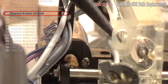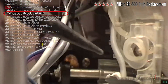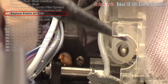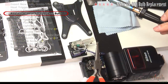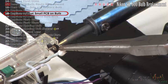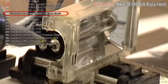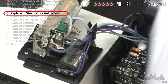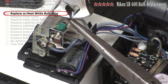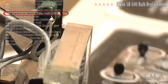Replace the end of the elastic onto the non-trigger end of the bulb. With your soldering iron, heat the small PCB and push it back completely onto the side of the bulb. Trim and strip the white wire, then with your soldering iron replace the wire back onto the trigger coil.